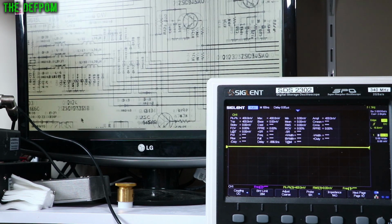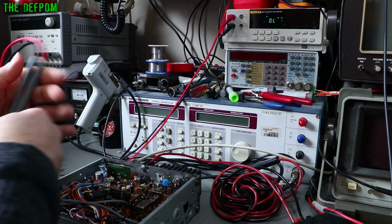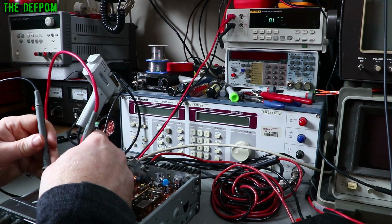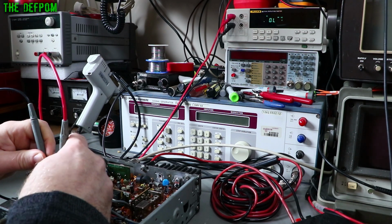So that is getting to the diode, but it's not coming back out of that diode, so that diode must be blown. So I've actually measured the diode to be absolutely sure that's what's wrong. I'm going to just get in here like I said. So watch the meter over there. I'm going to go backwards first.